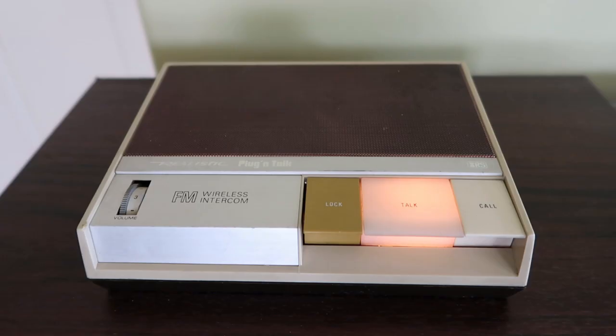They also suffer from rather low audio quality. They are decades old at this point, and they probably weren't designed for the interfering electronics there are now, and they would likely perform better in a timber house. Currently, they aren't that far apart, yet the interference is pronounced — I prefer there to be less. In any permanent setup, you would be much better with a wired intercom system.